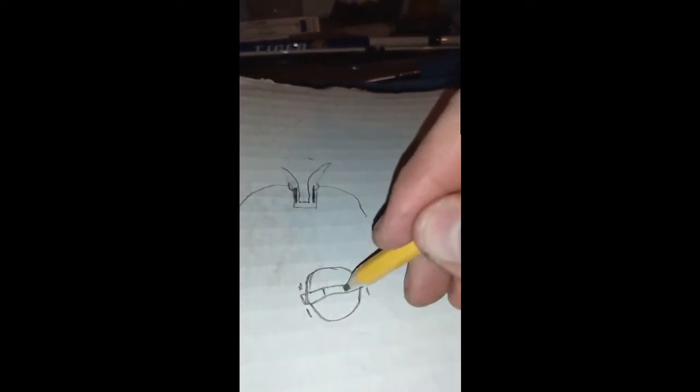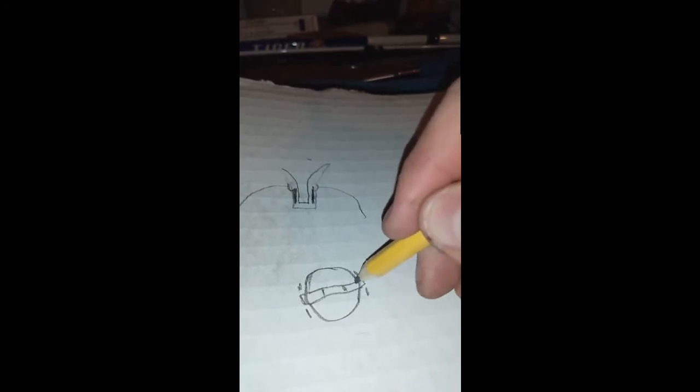And then when you're looking down and you have your slot there, you don't want it too small and you don't want it too big, because if it sticks out there, you're going to get tear out on your edges when you turn that screwdriver. So you can kind of see that there. You want it to be as close to the edge of that screw head as possible.